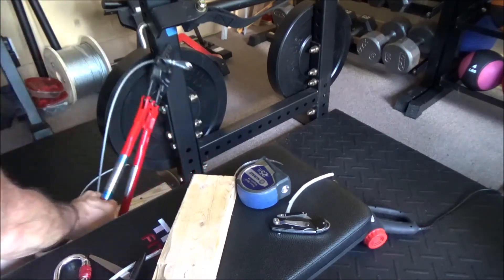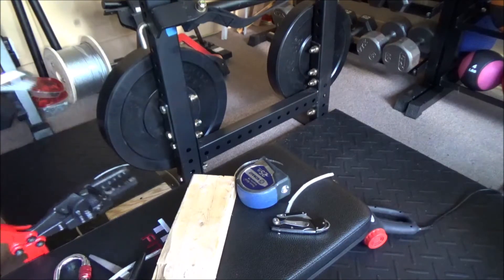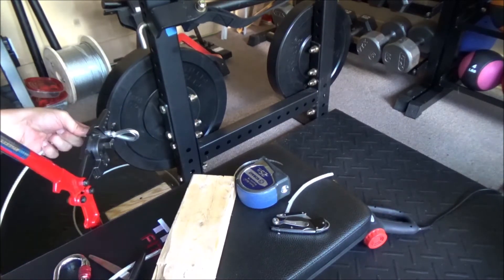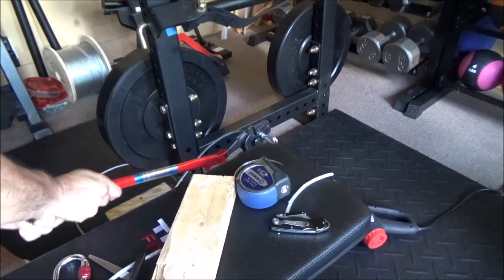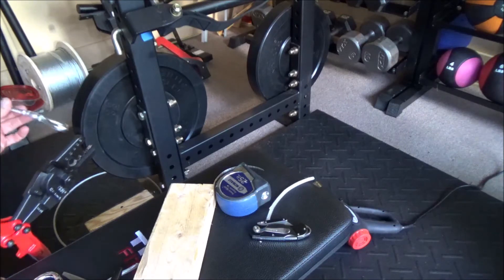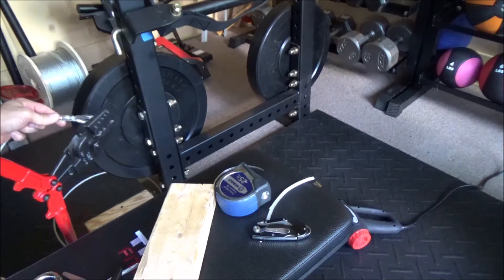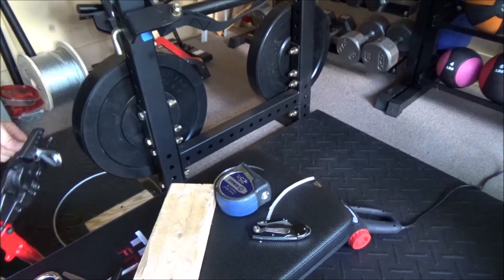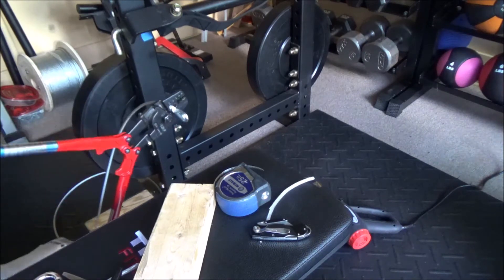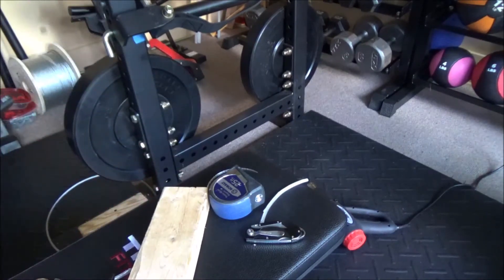Swage number two. So we've got that done — I can see I've got kind of the ends of it done — and then I want to swage right in the middle. Swage number three, and then one more on the ferrule on this side. You kind of do it as many times as you can, as many as will fit on the fitting. This would be enough, but then there's one last step I kind of like.